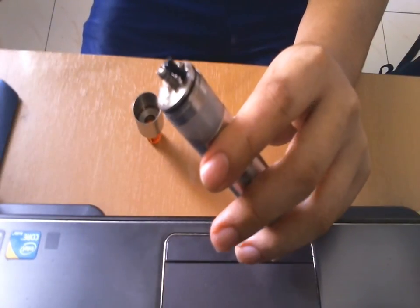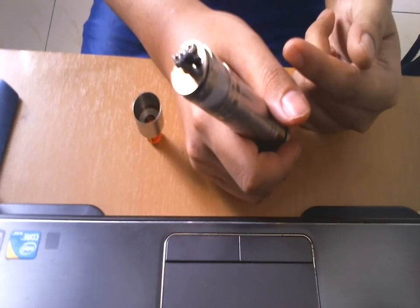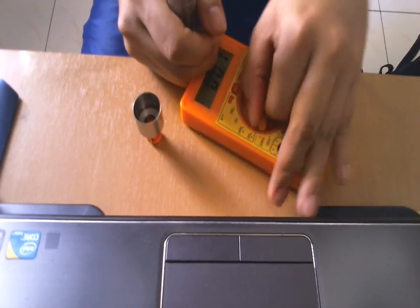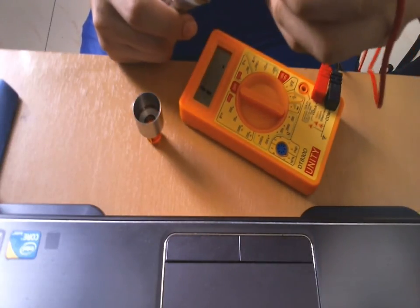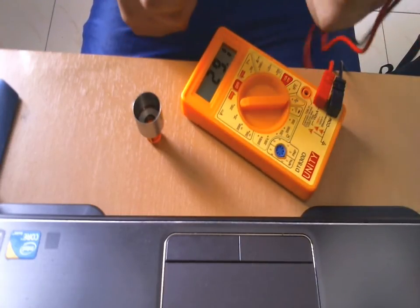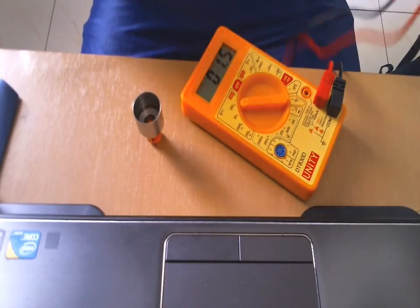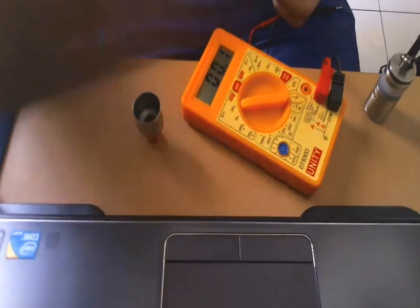It fires, but it's not even on a fully charged battery — the battery left is only about 3 to 3.2 volts, it's discharging pretty low. I'm gonna show you the ohm on this: 3 wraps of 28 gauge Kanthal, you get somewhere around 1.3 ohms. Let's see the voltage — it's only 2.6 volts. I think I just changed my battery, let's change to a fully charged one.